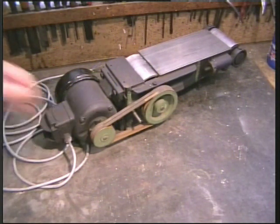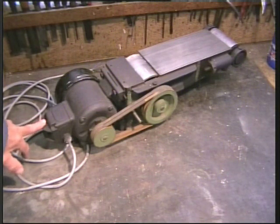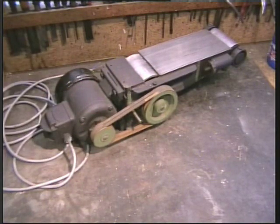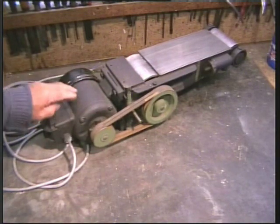We could replace the motor with a single phase motor. But single phase motors, size for size, aren't as powerful. And we can have problems in mounting it and belt length and so forth. So there is no reason why we can't convert them.